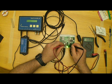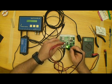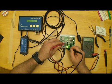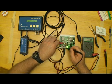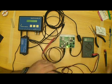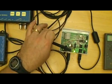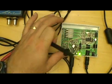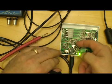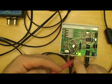Actually, that's close enough. So what we'll do is we'll just check the voltage there — 4.75 on this one pin right here, the one that I was telling you about. Let me zoom in a little bit so we make sure we're getting this right. And we want our voltmeter to read five volts, maybe a hair less.